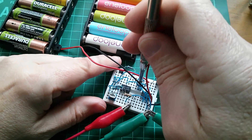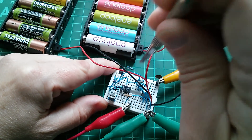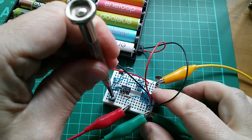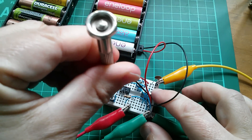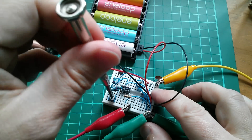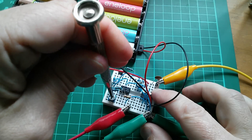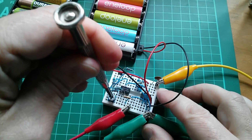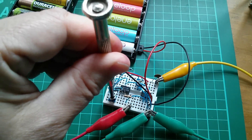This is my output level, so I can increase that. But this is my voltage-controlled gain — so if I take that down to minimum, I have no signal. If I take it right up, you can see that it's working as quite a nice linear control of gain. Of course, varying the level of an audio signal with a potentiometer isn't terribly impressive, because potentiometers can do that on their own without all this additional circuitry. So what we really want to do is feed a modulating signal into this gain input to modulate the level of the audio.